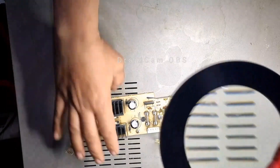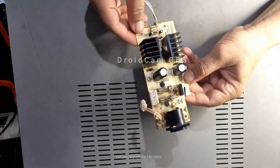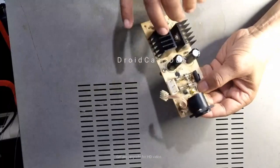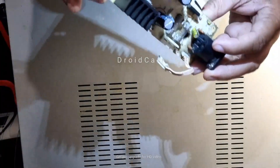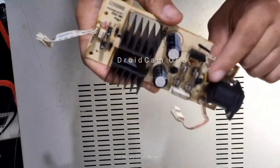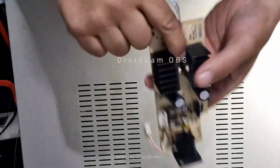So we've got this motherboard here, and I've replaced all the caps on this so far — they're not all soldered in yet because I'm waiting on one more cap to come. This is a 0.47 microfarad capacitor which I'm replacing on this board here. Then this board will be pretty much done, apart from these transistors or MOSFETs in this bit here.